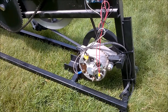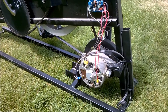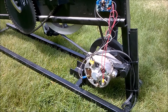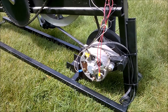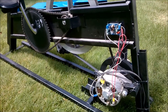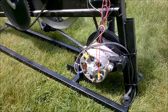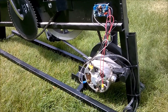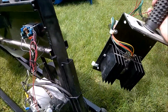However, when these six-volt batteries go dead, apparently these exercise bikes get thrown away. The idea with the alternator was that depending on the settings on the control panel, more voltage was supplied to the alternator, and as more voltage was supplied to the alternator it made the bike harder to pump — that is how it changed the resistance settings.